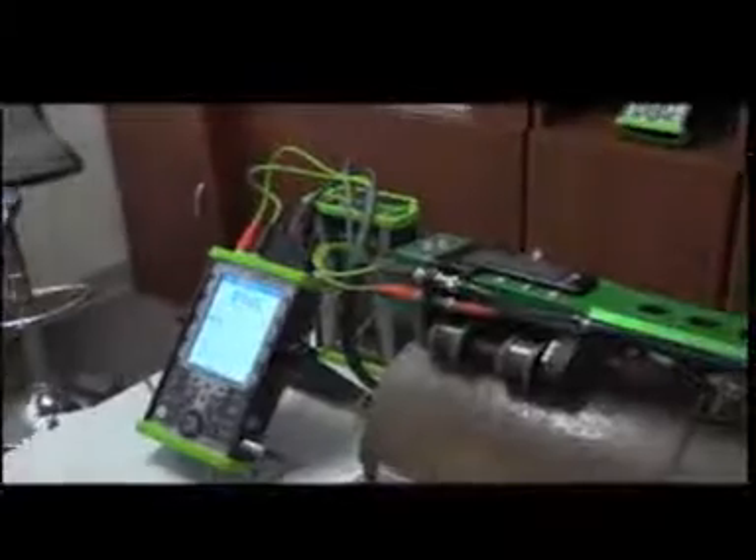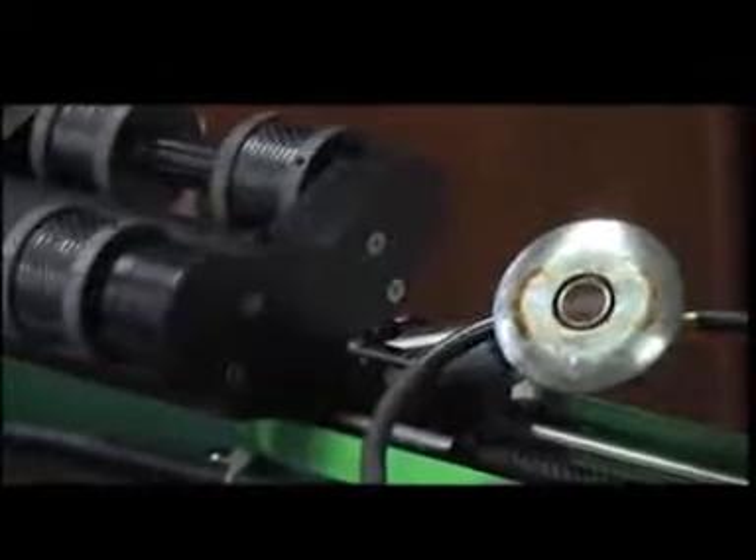The gray plug connects to the RCBU unit where it says scanner. Don't turn on the scanner just yet because we have to select that in the Raptor. We're using a dual element transducer on the scanner. We want to calibrate that. You'll notice that it's got a split down the center of it — there's an element on each side. So we need to select that on the Raptor to be a dual element transducer.